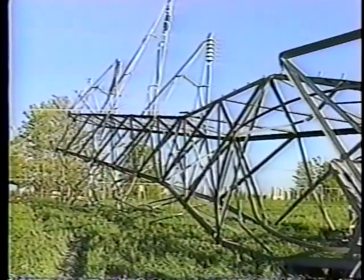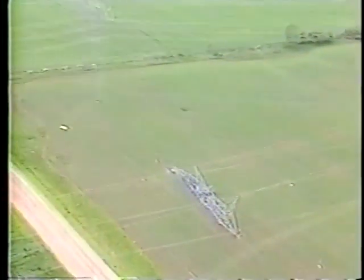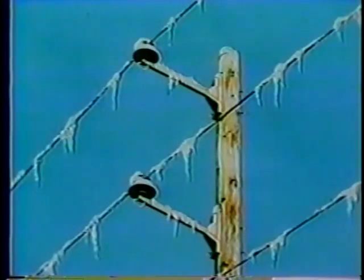So what could be the nature of a permanent fault on an overhead line? Well, one example is the collapse of the line as a result of hurricane or tornado damage to towers. Another weather-related possibility is the formation of heavy ice, which may stretch the conductors and perhaps cause eventual breakage. Another possibility could be, say, an aircraft or other object coming into contact with the conductors. All of these scenarios causing permanent faults are rare and unlikely occurrences.